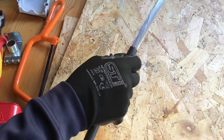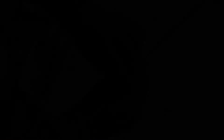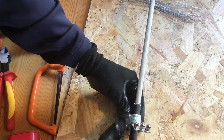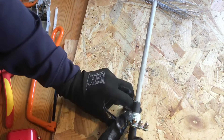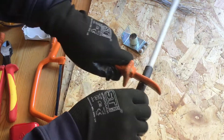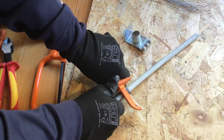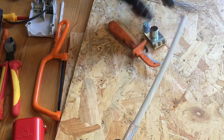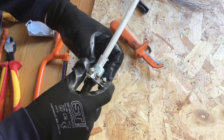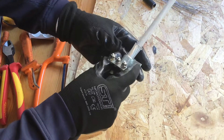There's only one way to do this next process, and as tempted as it is to grab a big bunch of these, it just will not work out. So I'm going to remove them one by one. Those steel wires are going to fold over here, so I'm going to remove the PVC sheath to my marking that I did earlier, being careful not to score the bedding.